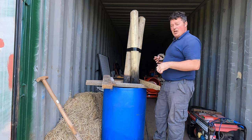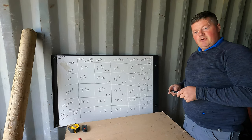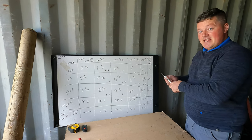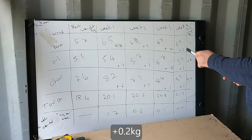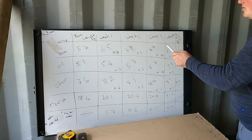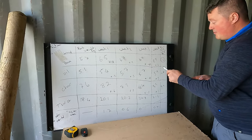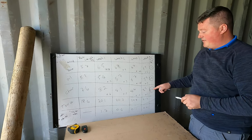We're 15 minutes into the video. I went ahead and took the week four weights: Base gained another plus 0.2, Oil gained another plus 0.2, and Char gained another plus 0.1. At the end of this test the total gain is: 1.2 kg for the standard/base post from the builders merchant, 0.8 kg for the oil post, and 0.9 kg for the charcoal post — the natural preservative.